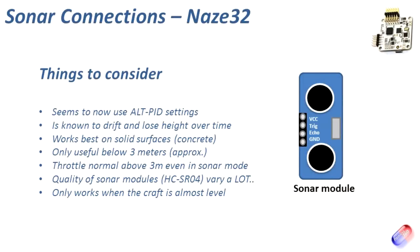Last couple of warnings and gotchas. It only works when the craft is level. What it's doing is firing a pulse of sound down to the ground and listening for the echo — the reflection from the surface. If you start to tilt the craft excessively, it doesn't work as well because the sound is going farther and the reflection comes back slightly weaker. So if you're flying really fast with the craft banked over and trying to use sonar, you're going to struggle. And the last thing: you can't land in sonar mode — always have another mode like stabilise that you can flick into to land the vehicle.